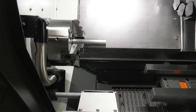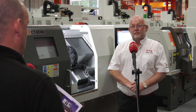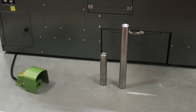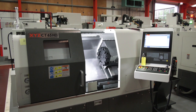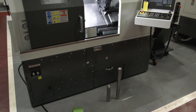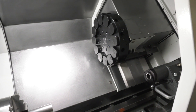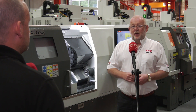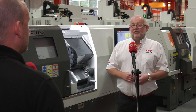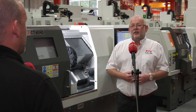At the opening to this video I presented the two different bar lengths — essentially that's what we've got here, a turning centre that can turn longer parts. It's a box way machine like the CT65 was, which we're still going to offer for people doing bar work, but for those who want to do longer jobs there's now the CT65 HD. The HD refers to heavy duty and the box way construction, and it's also a way of differentiating for spare parts in the future.